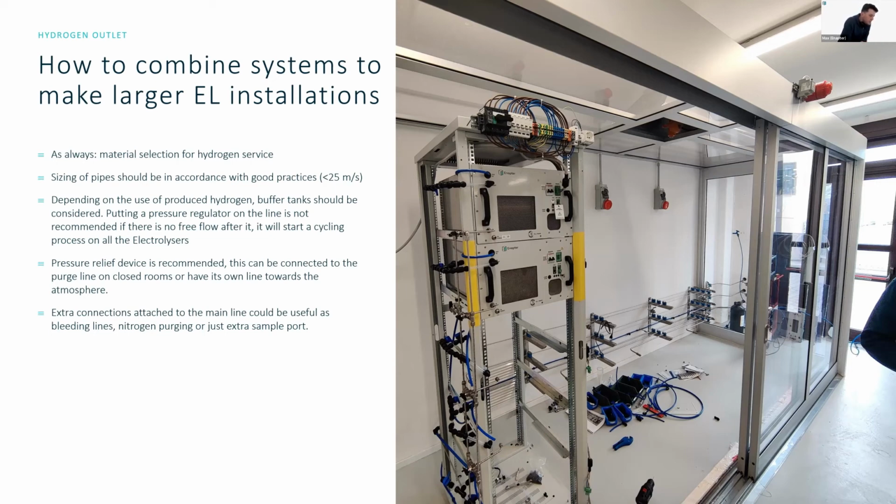What are the specifications for the cooling water? Oh, liquid-cooled versions we'll describe later. 1 liter of water a minute. Is this correct? The EL 2.1 data sheet states 0.4 liters an hour. Oh, no, the input water of the electrolyzer. So when they refill, they consume 1 liter a minute momentarily, but the actual consumption is the same. So we still consume about 400 milliliters per hour of DI water.